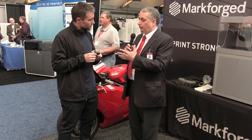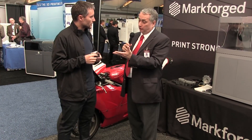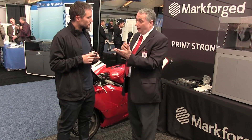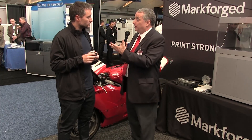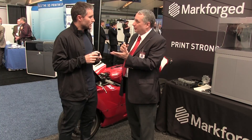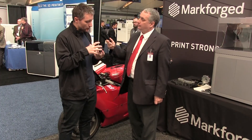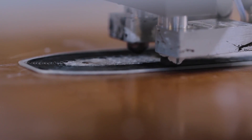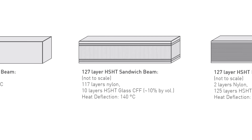Carbon is one of the original functional fillers with some strengthening effect, but to get really high-strength parts historically you need a very high aspect ratio fill material, which has created enormous problems in filling molds — it's hard to extrude, hard to move with very long needle-like reinforcing fillers. In this case, we use very long fibers in two different ways: chopped fibers go into the nylon used to print the shell, and then inside we print a continuous strand of carbon fiber, once per layer. It fills from the outside in, the inside out, or in isotropic patterns. You can create sandwich panels and dynamically reinforce the part to be strong in any direction you need.